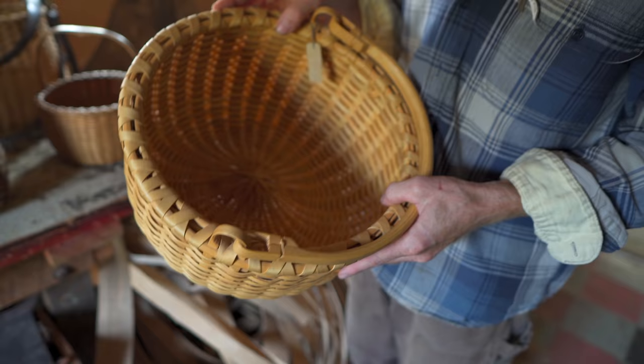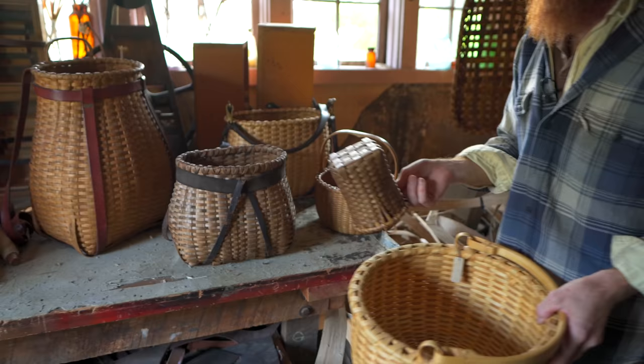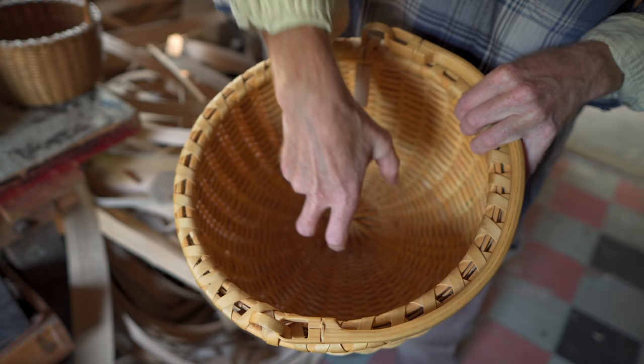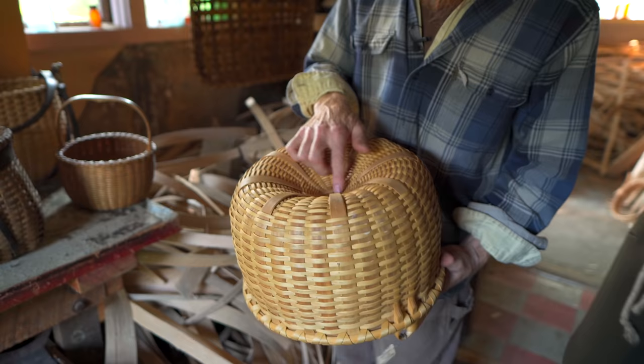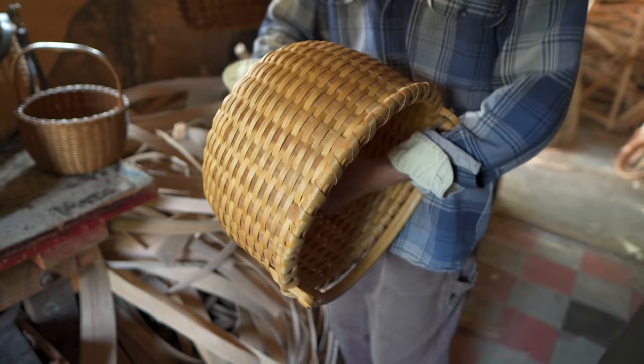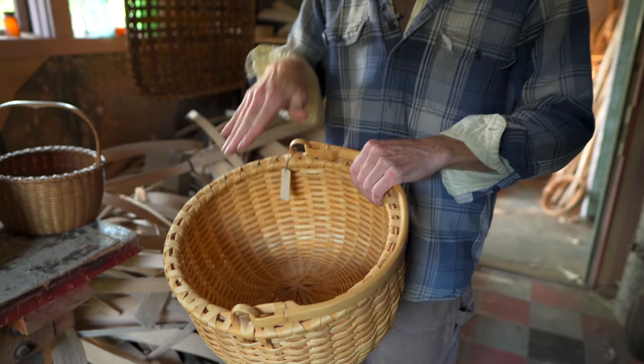And why is it so perfect? As opposed to a flat bottom basket, where all the weight is in the bottom of the basket pushing down, this one, because you're going to pick apples or something heavy, potatoes, it's nice to have this peak where the fruit or the vegetable can be pushed to the side, distributing the weight. So they came up with this stack of eight. Normally that's all you would have, one layer, and then they added a second layer on top of that. So there's so much wood there. There's more than a solid inch of wood. It's so neat. The way it directs material to the side and distributes weight is great to me.